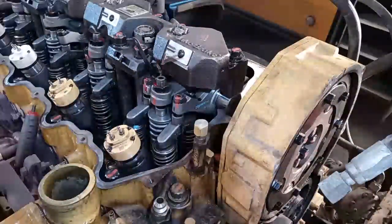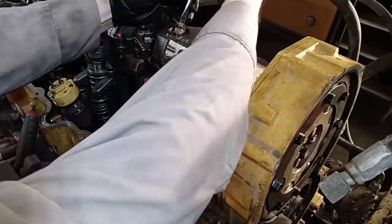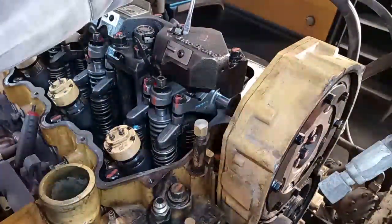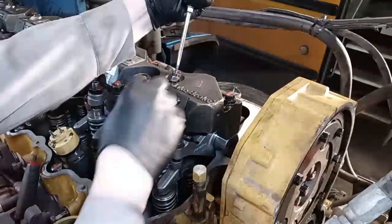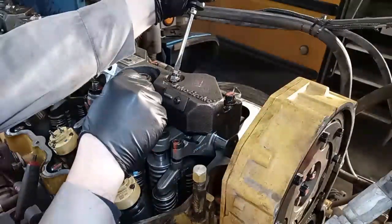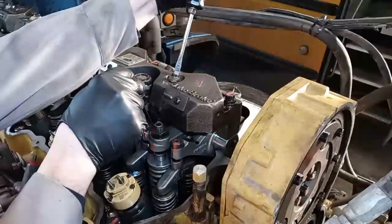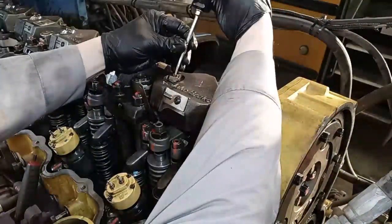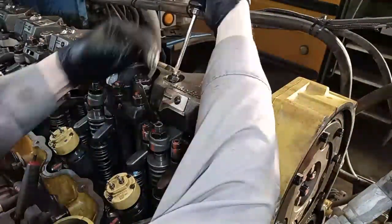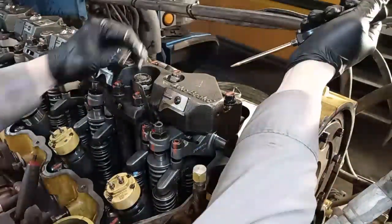For the jake, you must have adjusted the exhaust already. The adjuster isn't free-floating like the rocker arms — it's much harder to turn because the jake brake housing is full of springs and fluid. Per the manual, go until it contacts the feeler gauge — basically light drag — then go a full rotation past, similar to the intake and exhaust valves. Then wait a minimum of 30 seconds to help push out any oil in the adjuster. If you don't want to use a screwdriver, you can use a screwdriver bit and a ratchet.